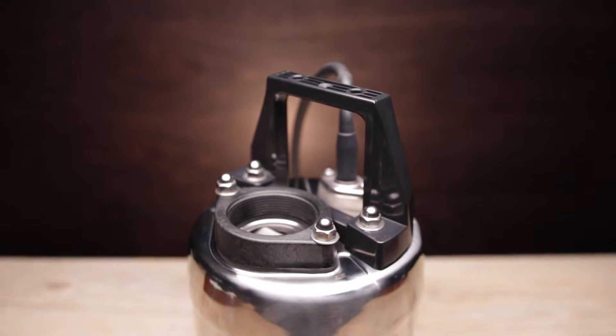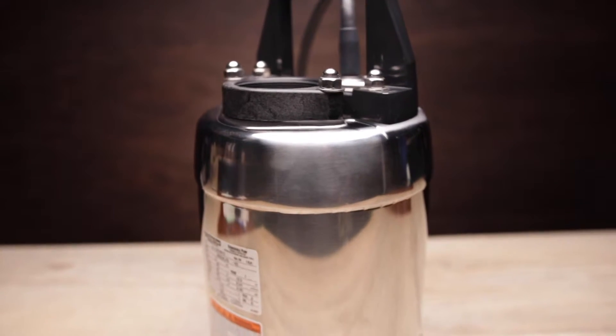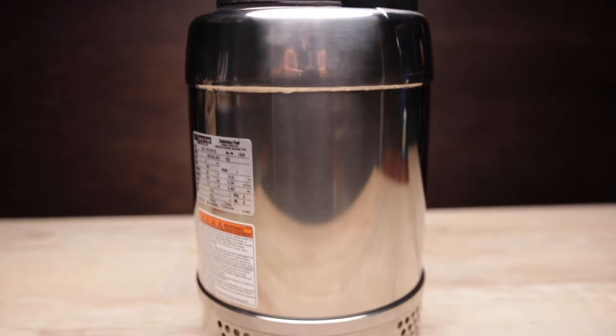The 50 SQ 2.4 S is a one-half horsepower, 115-volt single-phase submersible dewatering pump that only draws 6.5 amps — extremely low. It comes with a two-inch discharge flange, a 32-foot power cord, and weighs a solid 33 pounds. It operates most efficiently in the sweet spot of 34 gallons per minute at 24 feet of head.